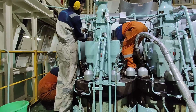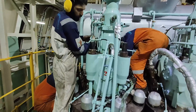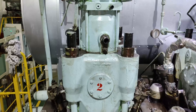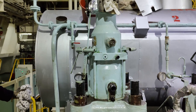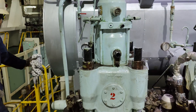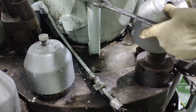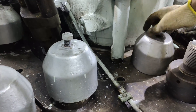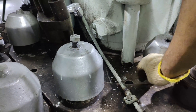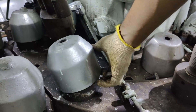Disconnect all the bracket securing arrangements and other small pipe connections from the cylinder head. Please do recheck and reconfirm for any leftover connections. Please do watch carefully the steps to loosen and remove the cylinder cover nuts using the hydraulic tools, as many engineers take shortcuts and end up damaging the hydraulic jacks.